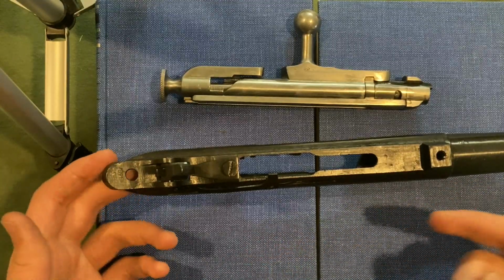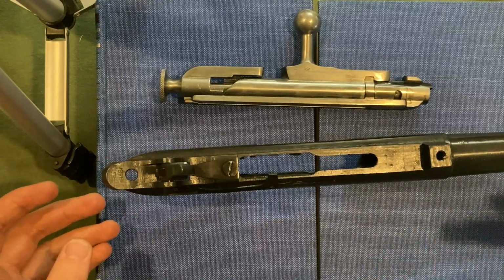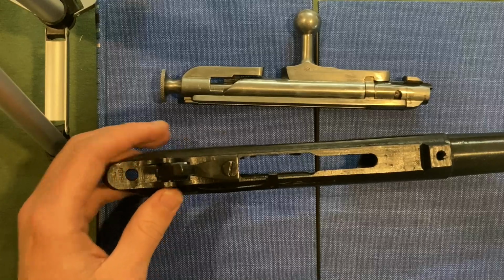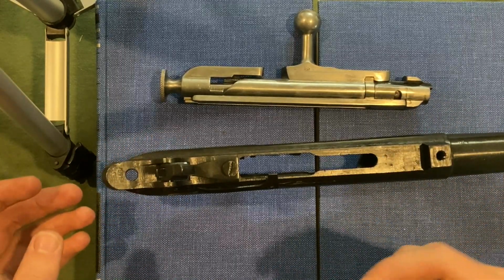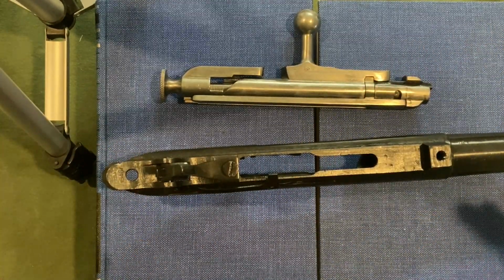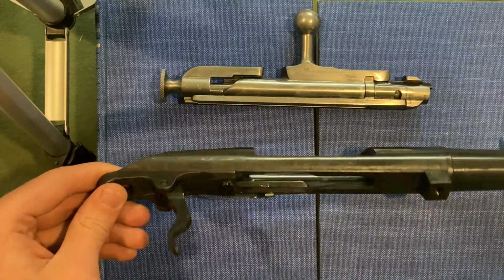You also should wipe off this whole area of the cosmoline, which can also be done either in hot water or just with like a heat gun that can also melt the oil. So it is pretty easy to melt cosmoline, you just need to get it hot. I've also heard of people just setting the parts out on a hot day, and all of the cosmoline would melt off, at which point they would just oil it up and clean it. So method 1, clean out your trigger.